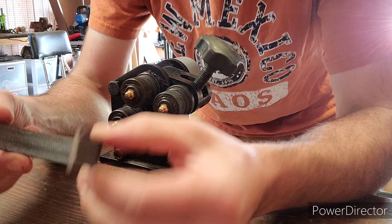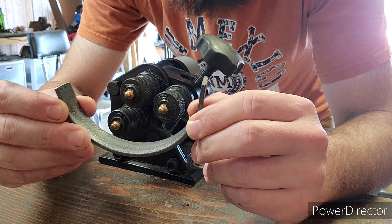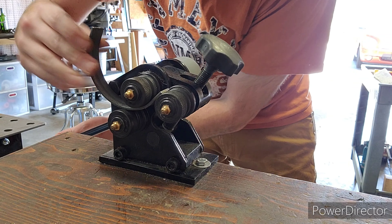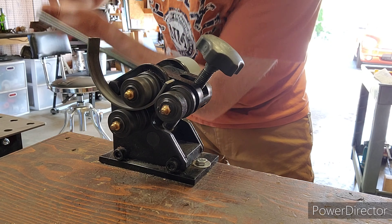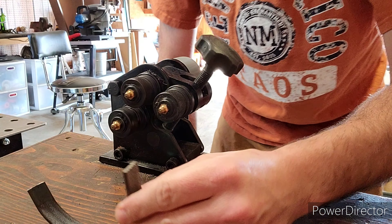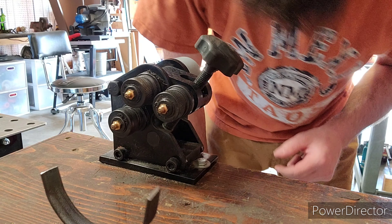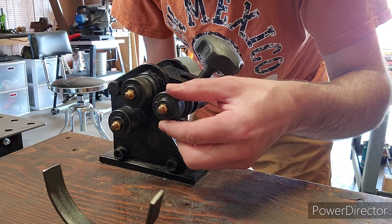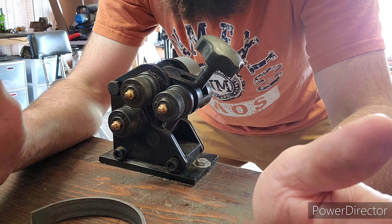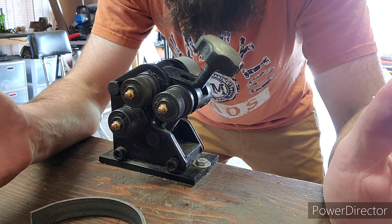Now for the purposes of this video that's just fine. So as you may have noticed when I'm rolling this, you can see how this wheel really cranks. This is why you want to go very slow with your rolling - if you were to send this through with this cranked out really high, you'd probably wear out and break this third wheel. Now this style roller is called a pyramid style roller because it has one, two, three wheels - looks kind of like a pyramid.